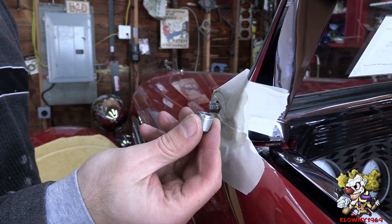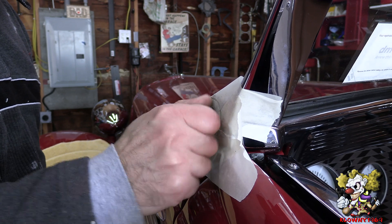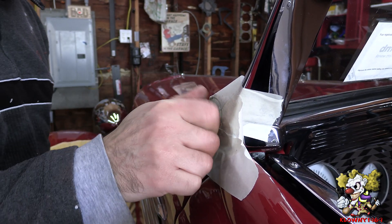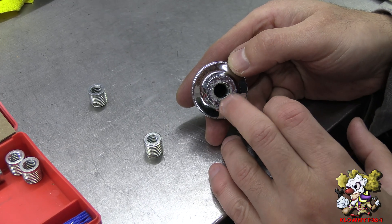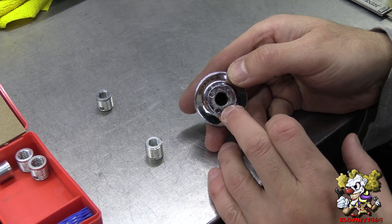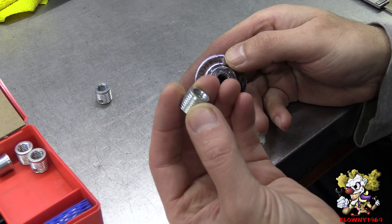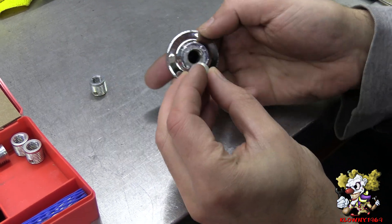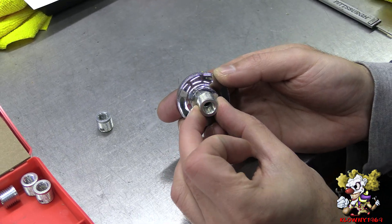There she is — the new threads. These are the threads, this is what they look like, and I'm going to see if this insert is going to work. And it looks like it will. So for the knob, the threads that came with it were 7/16ths, but I have to put 3/8ths, which is a 16th smaller. This Big Cert kit is great for that — it has a smaller thread here, and the bushing is so thick you can just drill it and insert it and you're good to go with a smaller thread size.